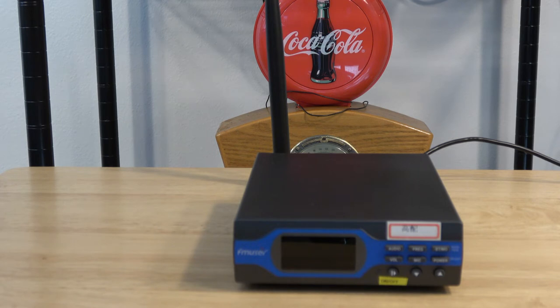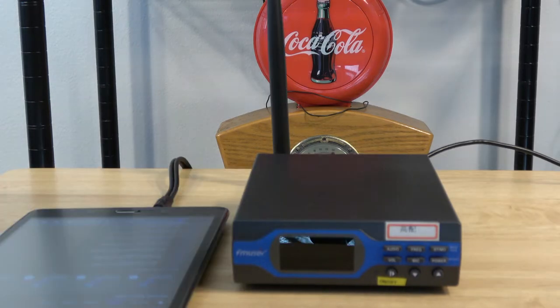The AC power supply converts 120 volts to 12 volts DC and is rated at 2 amps. For audio input I think I'm going to use my Samsung tablet going through the RCA inputs. I have about 2,775 MP3 files of old-time radio on a micro SD card, but the manual was pretty specific that it did not want over a thousand MP3 files on the SD card, or you could cause damage to the FM transmitter.